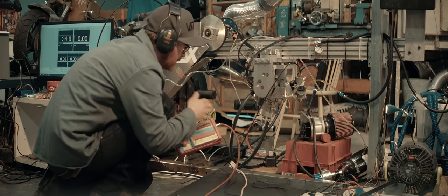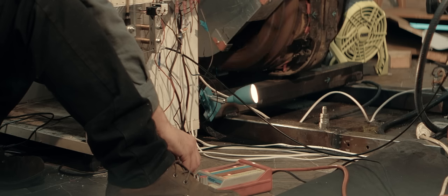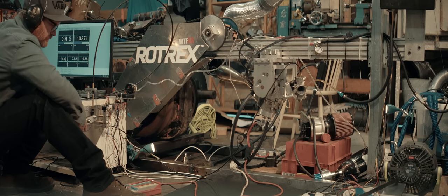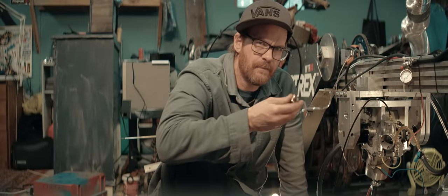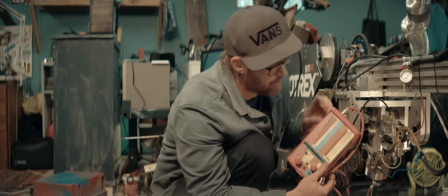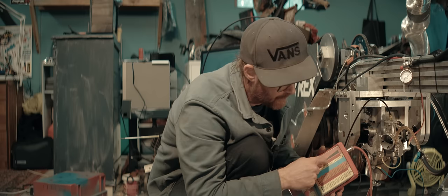I'm hooking up the ignition mate to see if the spark is dropping out. That fancy fine electrode spark plug with a large gap made it easier to get past the hump and into the power band. And then our issue became apparent. It's cutting out. I was monitoring spark with the ignition mate. Did not seem like spark was dropping out, even when it sounded like it wasn't firing at all on its way down from a cutout. I could clearly see ignition here.